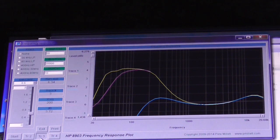So there's something a bit odd with these tone controls, I must admit. It could be that the carbon pot in the tone control is on high resistance, maybe with wear and tear. Okay, so it's better, but it's still got that big hump at 100 hertz, which sounds really quite boomy. And that's one thing a valve amplifier with this low power level doesn't need, wasting energy on the very low bass, because that's using all the power from the amplifier.